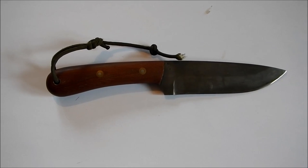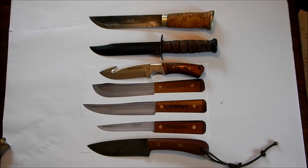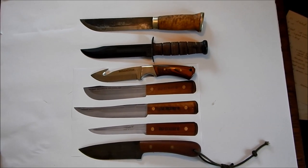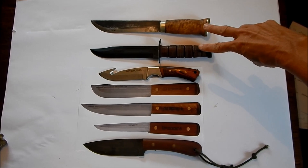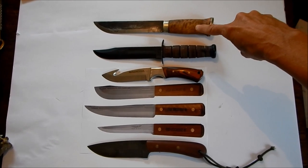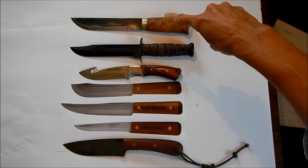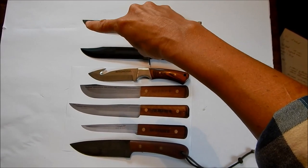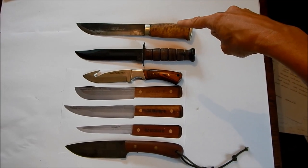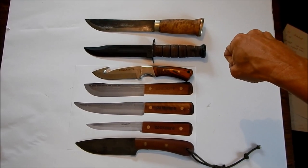So let's look at blade geometry and see what the shape of this blade tells us about what it was originally made for, comparing the knife to some other knives. Up here we have two general purpose knives. One is a Sami Loiku — a large chopping and general purpose knife used by the Sami, also for butchering large game like reindeer. It has the typical long straight slicing edge, the uplifted tip, and then pretty much a straight line to the hand, with a fairly large grip widening at the edge to stop your hand from slipping.